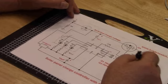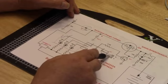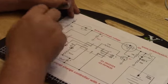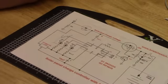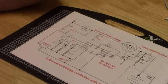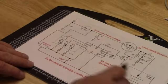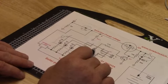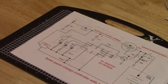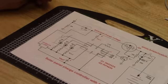Even though he was feeding the voltage in on X, which goes into ADC 0 on the Arduino, and then he turned around and fed the voltage from the battery from Y, which went through ADC 1. So, it works, yeah, but with the design and temperature variations, you can't depend on getting a 0 to 5 volt reading on your ADC pins. It could be 5.1 because of the temperature, it just throws the whole thing out of whack. So, that's not a good idea.